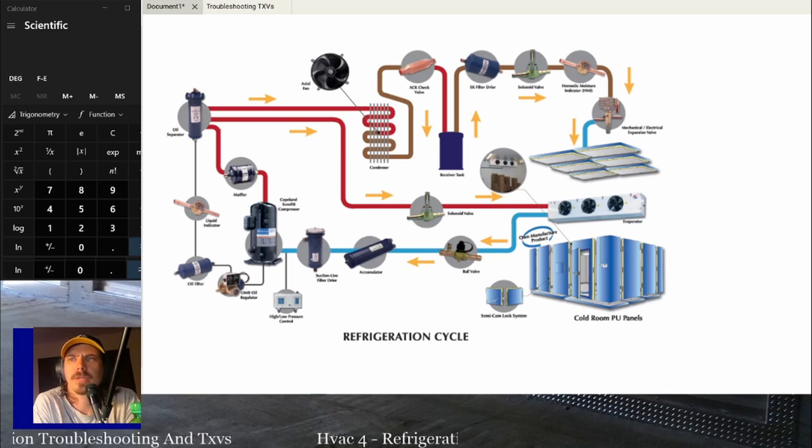Your next most common for residential is probably an accumulator. So an accumulator on the suction line to make sure that you do not get liquid refrigerant into the compressor, hopefully, unless it's grossly overcharged. Then your next most common is probably a receiver. So a liquid line receiver, which they got one pictured right here. So there's a liquid line receiver. Then with high efficiency systems, I would actually say your muffler on the discharge line is probably your next most common.